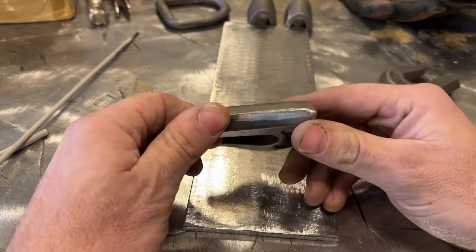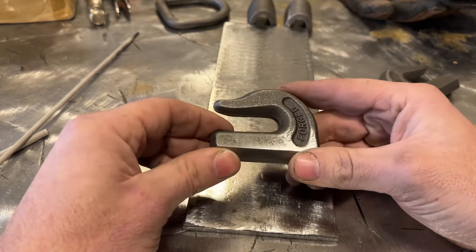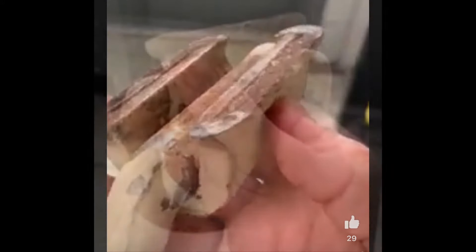This is something you can weld with flux core wire, stick weld, or TIG weld - but do not use short circuit MIG. On this thick material and a forging welded to say 3/8 plate, you're going to have zero - repeat, zero - penetration and it will rip off. I'll show pictures now: here's a D-ring welded to a shipping container that failed upon picking it up. The weld essentially didn't penetrate at all into the root.